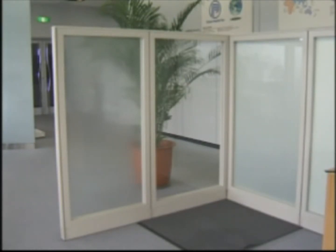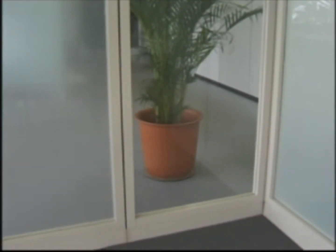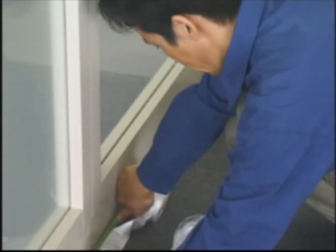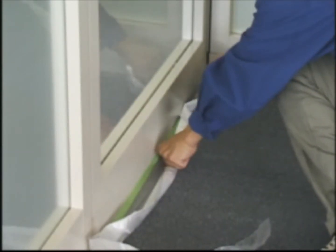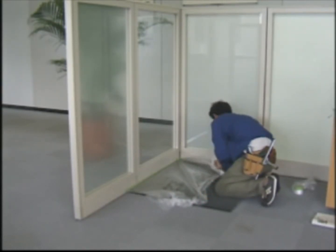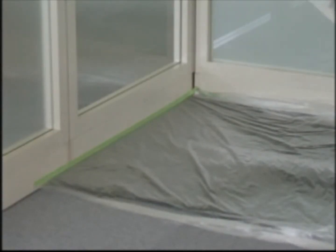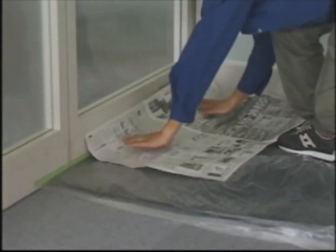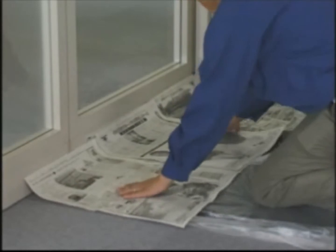Site preparation. It is first necessary to waterproof the area. Use plastic sheeting to protect areas over which water may splatter during application. This includes floors, desks, lower walls, and whatever else may come in contact with the detergent and water solution. You can also spread sheets of newspaper over the plastic sheeting on the floor. This will absorb water and make cleanup quicker.